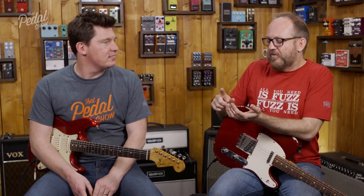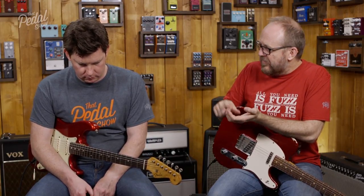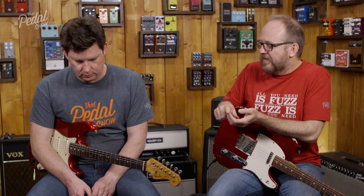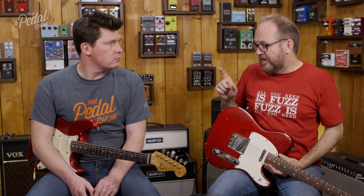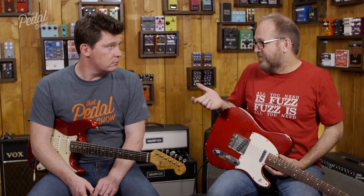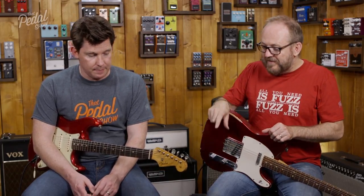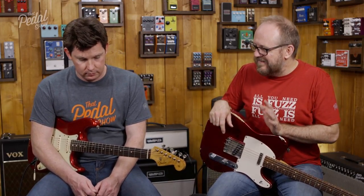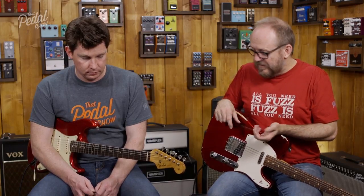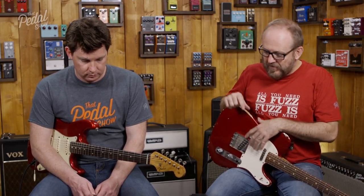But one of the things about vintage electronics, which I sometimes struggle to get my head around, you know, the components that are inside these electronics are not designed to last forever. I can see that guitar being looked after, lasting another couple of hundred years. Why not? If it's looked after, it's like a piece of furniture, they can last hundreds and hundreds of years. Yeah. The electrolytic capacitors in these things will only last 25, 30 years at a push, and then they break down. This is what they do. Especially in some of the components that were made the way they made them back then, they're not designed to last forever. So a lot of vintage electronics, it's going to break down.